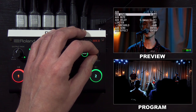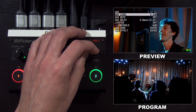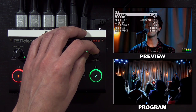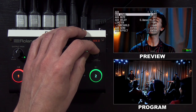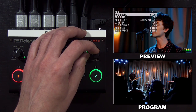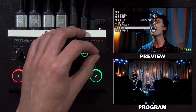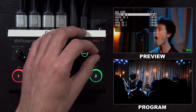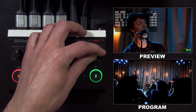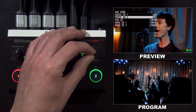For the aux audio mix, you're able to send sources to this separate mix. So if you want just the microphones and no music input, you can adjust the send levels for your sources to create what's called a mix minus. In the aux send submenu, they're all turned down by default, so you would bring them up to zero dB for the sources that you want to become a part of that aux mix.